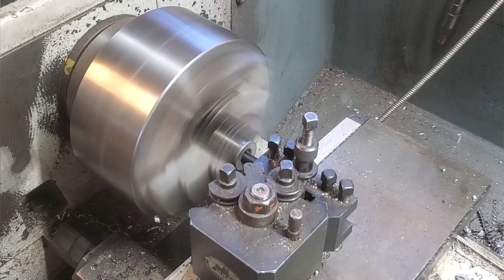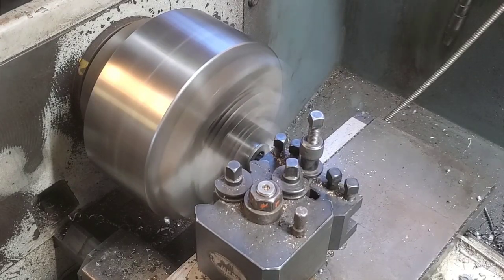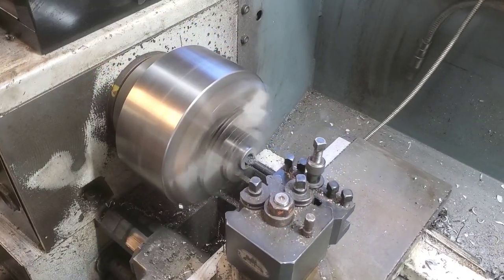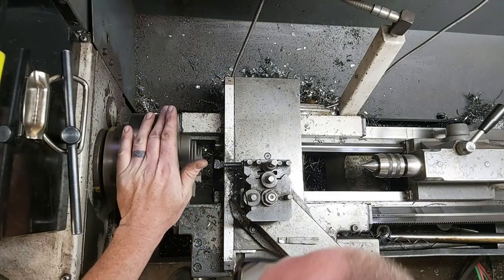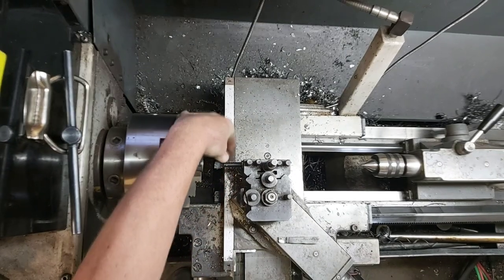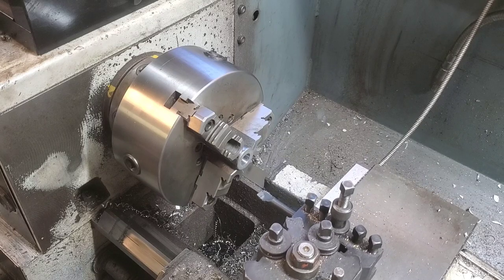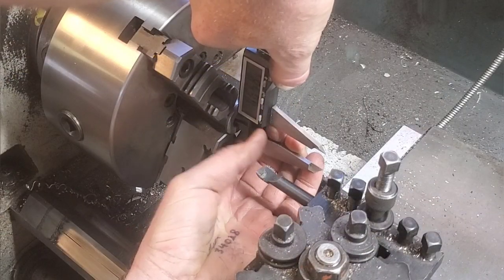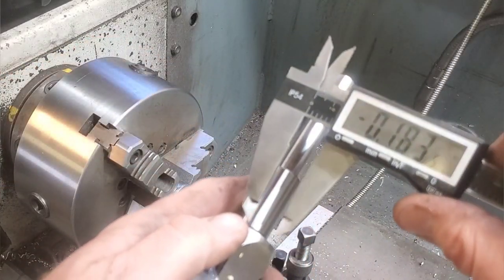What's happening here is because it's going so fast, it's creating a frequency where the tool bit is bouncing on the inside of the work. This is causing it to cut and then throw it out again, and then it jams back into it, creating a frequency of back and forth and the sound that you're hearing. It also ruins the surface finish. Later on in the video, you'll notice where I slow it down — it's going to sing a really happy song and give an amazing surface finish that the customer is going to be very happy with.